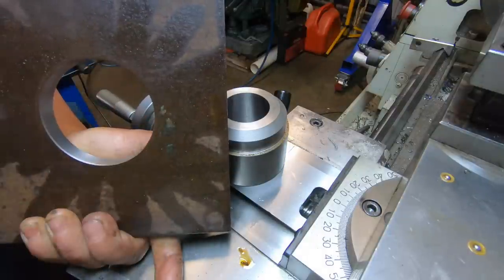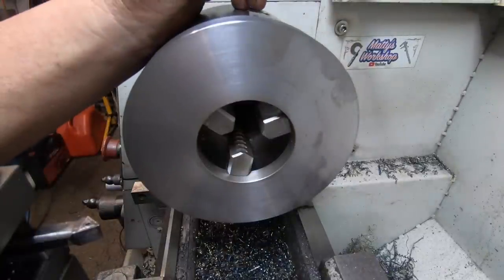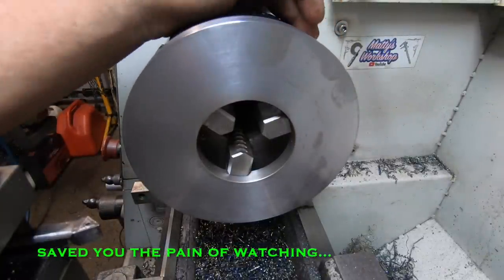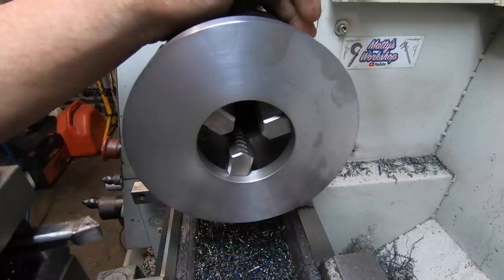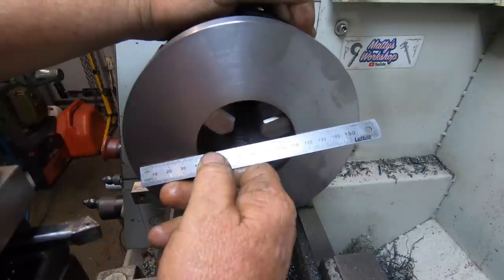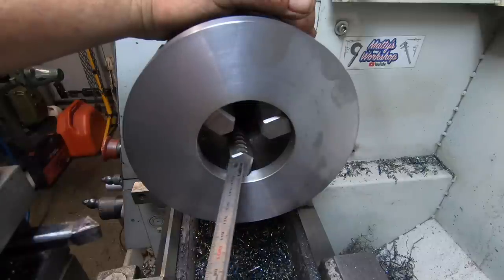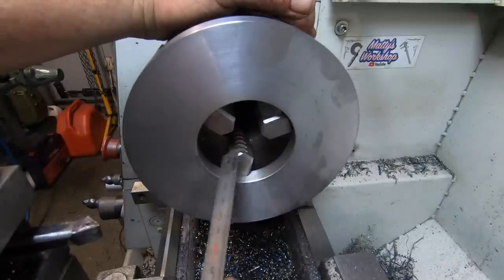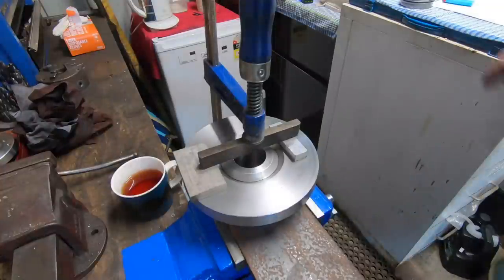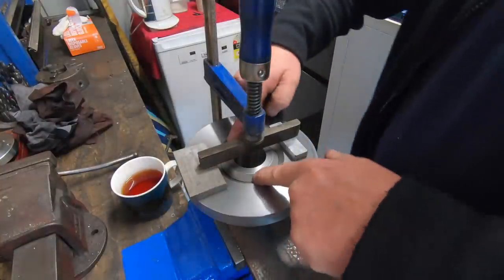to the right dimension of the chuck, which is 160 mil, and just like that, it's nice and round. So that is well over 160 at the moment. I'm going to leave it at that, and then once it's all welded together, then I'll machine down the outer to the final dimension. Okay, so what I've done, I've got this all clamped up, ready to weld this V